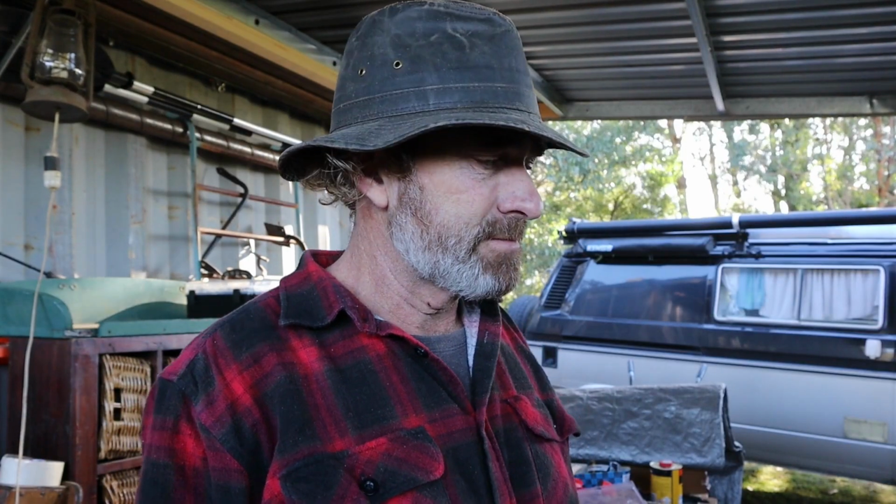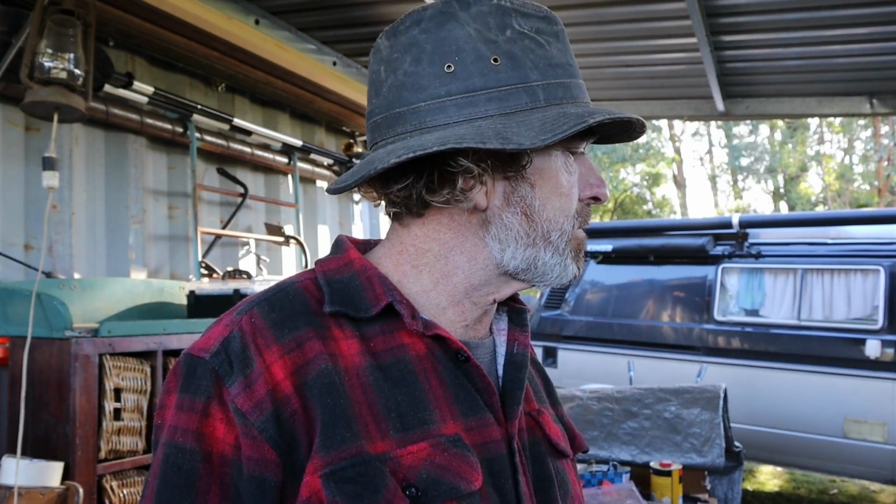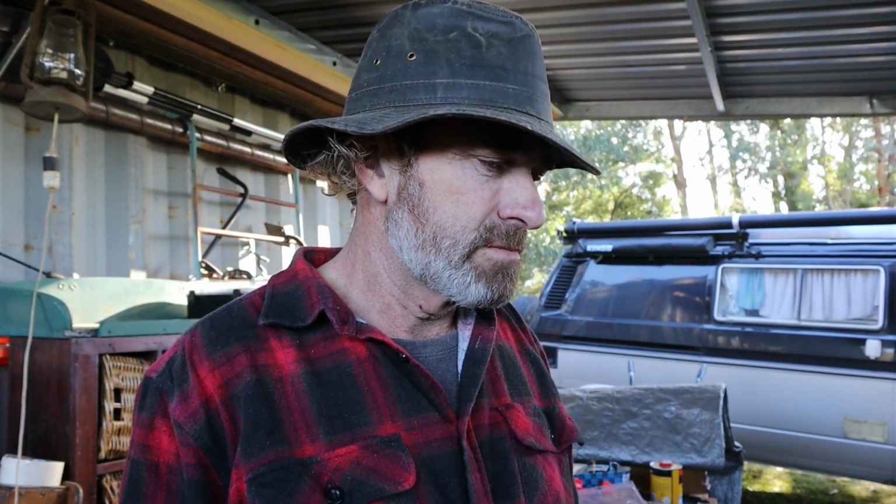So there you go. Don't be afraid to apply the paint stripper thick, even though it can be a costly item. Don't have a little snooze after lunch, thus elongating the time that I left it before attacking it with the steel brush, which gave it time to dry out. And aim to get it all off so you don't get that noticeable visual finish of scratched paint, albeit painted.